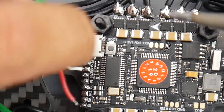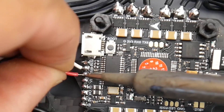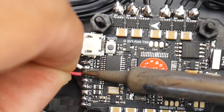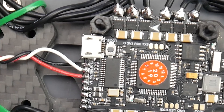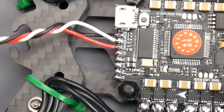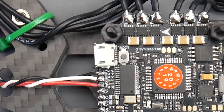These pads are pretty small, so you've got to be a little bit careful when soldering in this area. Everything is really cramped together and there are a lot of components very close by. Just take your time, make sure you're comfortable. Our receiver is basically complete and everything's looking good — a small tug shows us they're installed correctly.